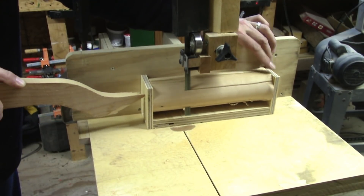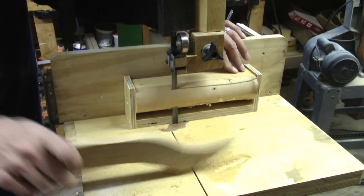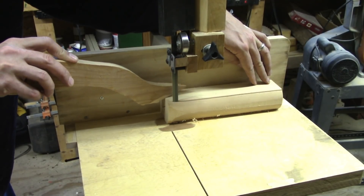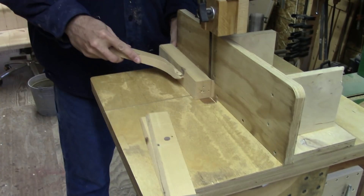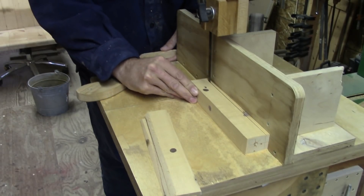This is a pretty fair facsimile of a head saw at a large mill. It'll take the round log and push it through the band mill, squaring it up into a cant. The squared-up cant at the mill will then be sent through a resaw, which peels off boards one at a time.